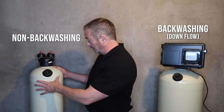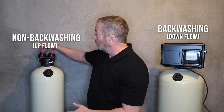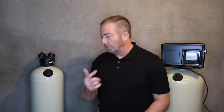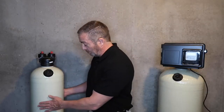With the non-backwashing system, we install this as an upflow. You'll come in on this side from the well, and the water will go down through the center distributor tube, come up through the vortex plate, moving the water in a circular motion through the complete diameter of the tank, and come out the other side into your main house line — which is extremely efficient. So every time you use water in this system, it's just like it's being backwashed.